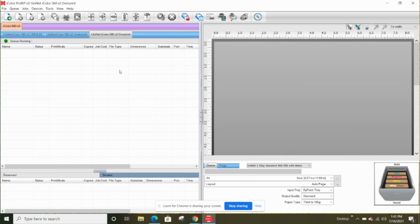We're going to work in the Overprint tab. This is for when you want the color to be printed and the white to go over top of it. That happens in a single pass on the iColor 560 white toner printer. Essentially a layer of white is printed over the top, so when you flip your design onto a dark surface it gives you vibrant colors because of that white underbase.